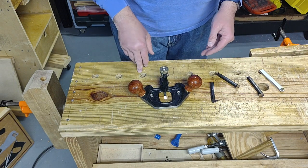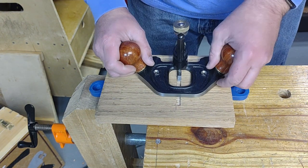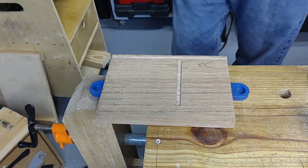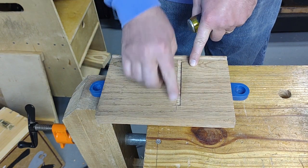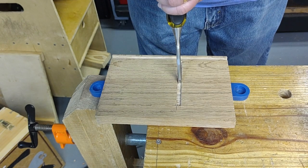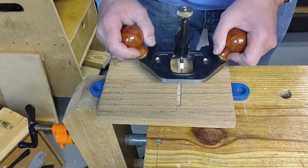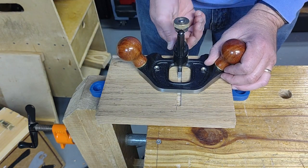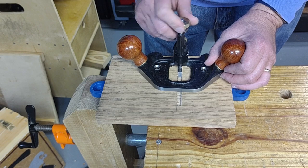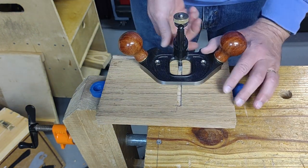These are just the sizes I use. Here's a good example — this is a piece I'm working on currently. What I've already done is marked it out with a razor, defined the two ends, and worked it out with the chisel and a mallet over time. I didn't use the router for all of this — I got it down to a certain point. This is more for leveling it out. So I place it over there, loosen the pin that holds it, bring it down to the level I need, and I'm just able to run it right through.